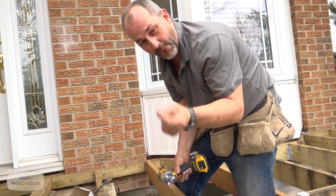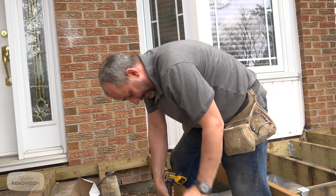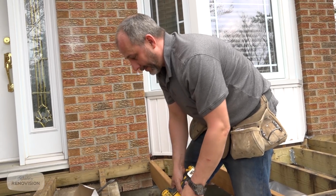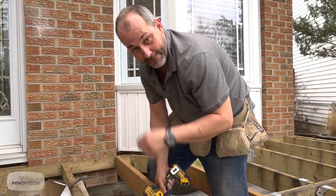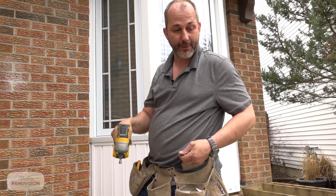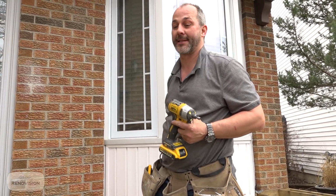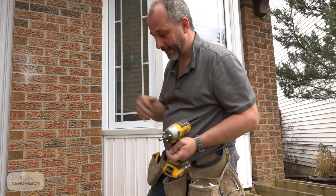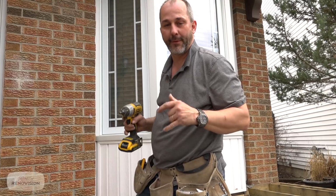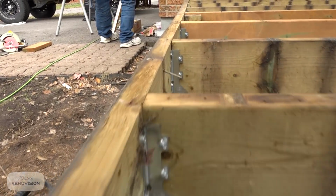This is an alloy. It's forged. It'll never rust, period. Not like galvanized nails, not like ACQ screws. That will never rust. And if you aren't using a forged alloy on your Simpson Strong Tie, you'll fail inspection. And sooner or later, one of these days, it'll just fall apart. The copper in the pressure treated lumber is what causes the oxidation that kills your screw. So the coating only protects it for so long. That's why when you're dealing with structure, we deal with point load, we deal with brackets, we deal with forged screws. Those elements will never rust and will never fail. I mean, all the boards can lift off and rot off, and that's fine. You're not gonna fall through your deck.